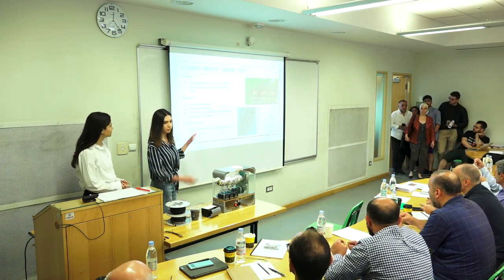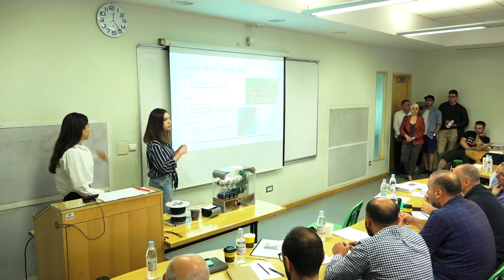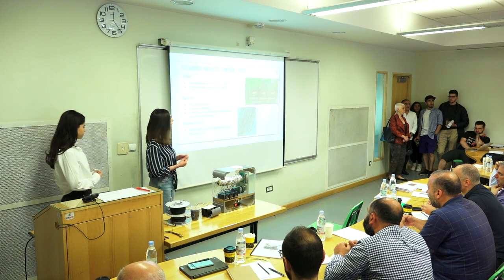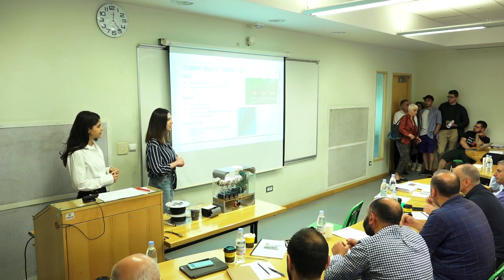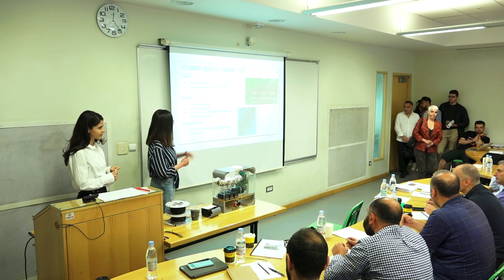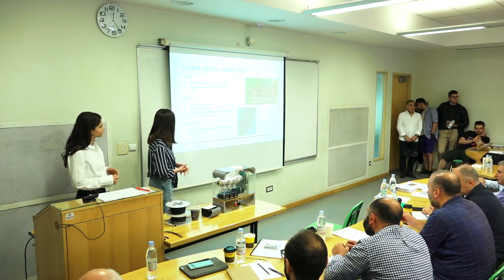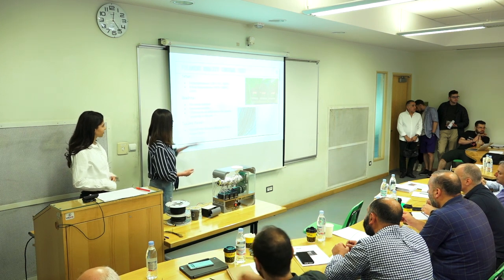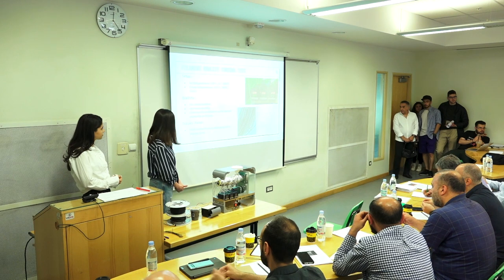And as you can see from the samples that you have, the product is more ductile. It doesn't break easily, and there are no visible bubbles inside it. So yeah, we got very good results. But it was our own approach. It wasn't what was recommended. And we got good quality at different motor speeds, and especially at 18 RPM.